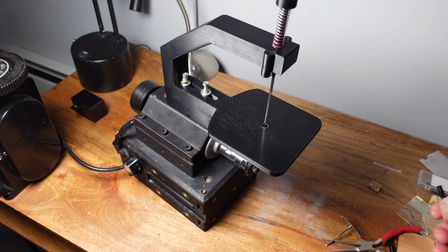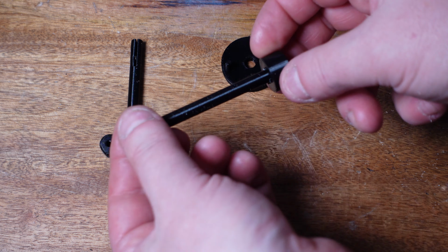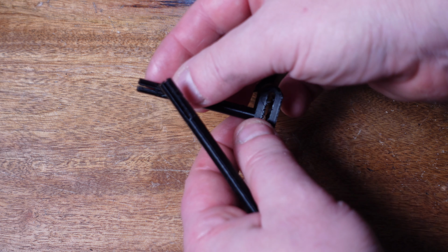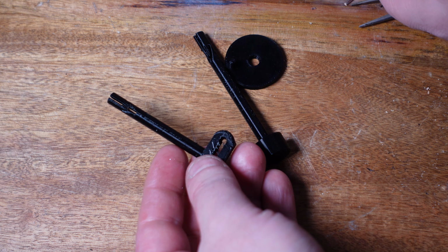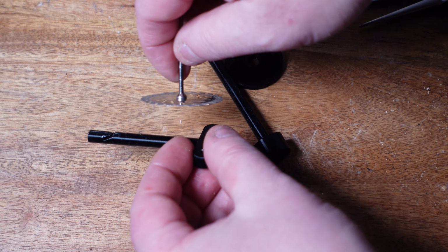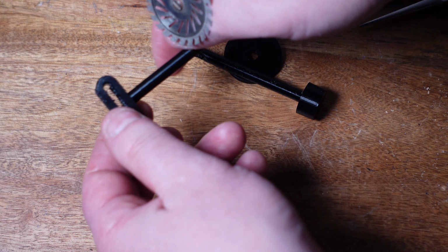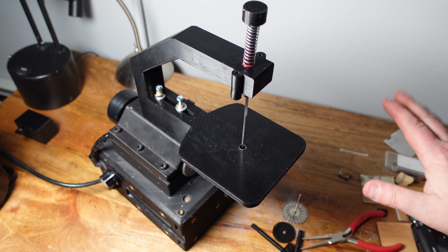There's just one thing that I want to show you. These are the 3 mechanism parts as they come off the 3D printer. Before you insert them into the machine, you're going to want to sand this perfectly smooth. You're going to want to grease it up. And then there's a little V shape here that this is where the blade attaches to, over here and over here. It's very fine resolution and it's difficult to get this perfectly on an FDM printer. So what you need to do after the part comes off the machine, I'm using this, you could use a cutoff wheel or a diamond wheel just to open up this slot here and then open up this slot here just to get rid of any stringing or any support material that might be in there. You got to do that to that piece and this piece. And then also, with a drill bit or something, you need to clean out the inside of this hole so it's nicely, perfectly smooth.